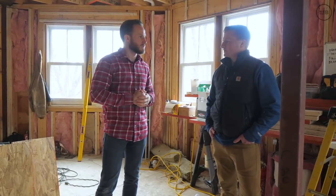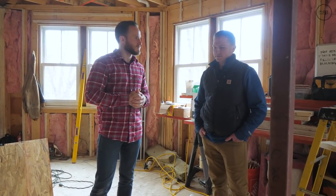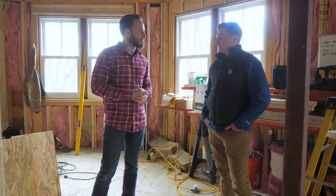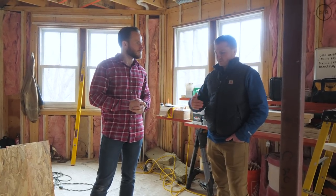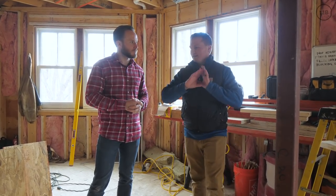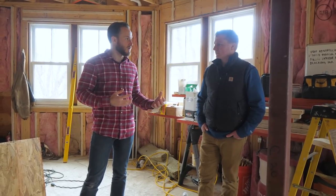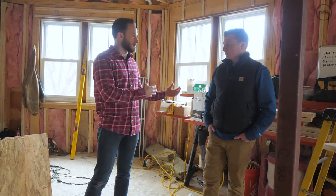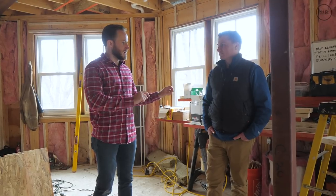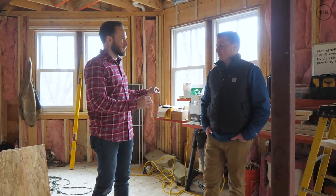Once we get through the ceiling details, we'll start all the interior walls. We have rounded walls for this oval bedroom that are going to be challenging but fun. We'll start with the oval — we have our center points, we'll lay it all out on the floor, cut our top and bottom plates out of plywood using a router with a jig. It's also critical where we stop the curve and start, because the back wall connects flat from post to post, and then the two sides are just curved. In a future episode we'll walk through the oval layout. We also have the complexity of an oval niche plastered in place, a museum base detail using a custom-bent extruded aluminum shadow reveal, and this oval bedroom essentially dictates the rest of the space — the closet as well as the bathroom.